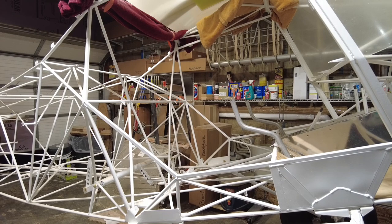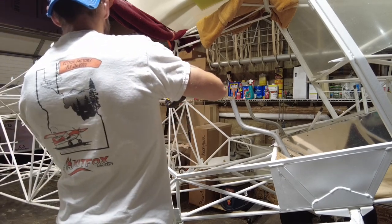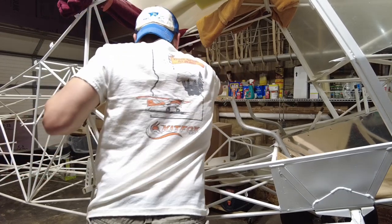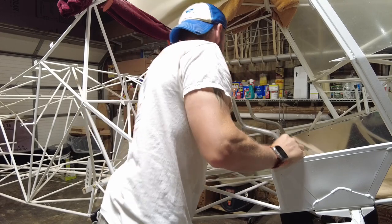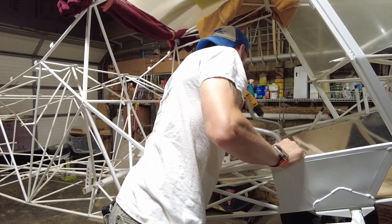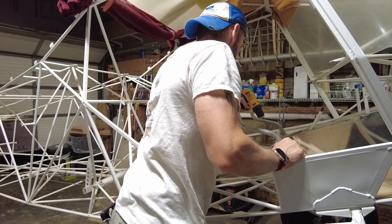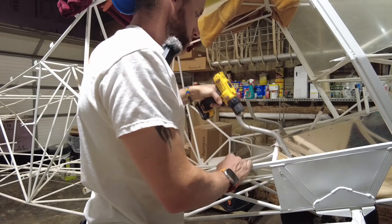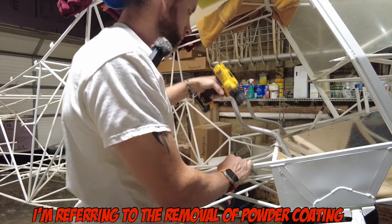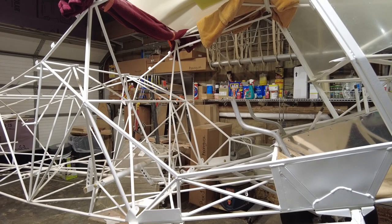I did mention that the 0.1875 reamer is much larger than the 3/16 bit. Now, that was a misstatement on my part. But what I did see was that the holes that were in the fuselage tabs were just much smaller than the 0.1875 reamer, and I thought that they had already been drilled to 3/16. So I stand corrected. Not much comes off with the number 40. So that's done. Now we'll match drill the seat pan.